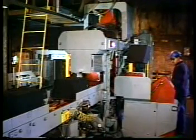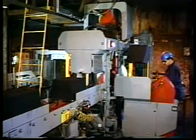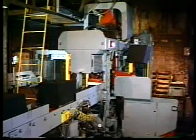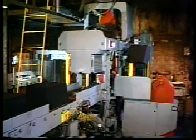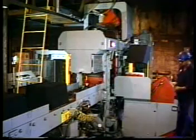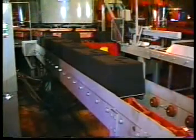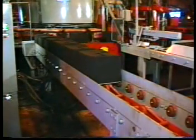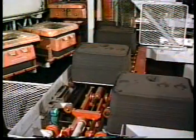The mold is pushed out of the molding machine on an aluminum bottom board onto the accumulating mold conveyor. This provides mold storage and transports the molds to the turntable on demand. The length of the conveyor and corresponding number of mold positions can be varied to suit individual customer requirements. This arrangement allows molding and mold pouring to operate independently or at different speeds during pattern changes or metal delays.